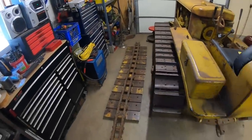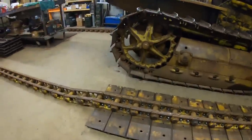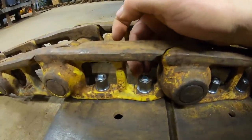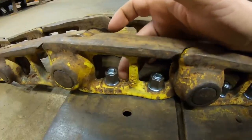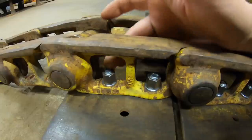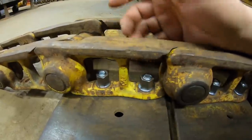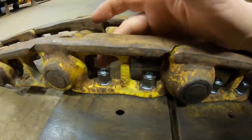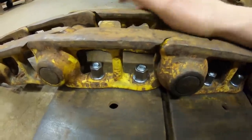We're as far as we need to go for now for track pads on the left side, and I also did the same amount for the right side. Coming back to those taller track nuts — this is why I prefer to stay with them. You can see they use every bit of the thread of the bolt with nothing sticking out above the nut. If I had gone with standard height ones, about half of that would have been exposed thread, which rusts and then becomes really tough to get the nut back off. Also, these links will trap rocks and the sprocket will pound them into those bolt threads and mash them over — sizing the nut to the length of the bolt so they flush out evenly is a very important detail when working with tracks.